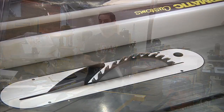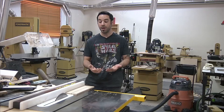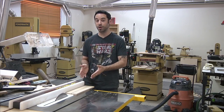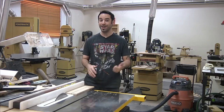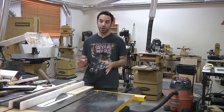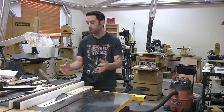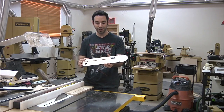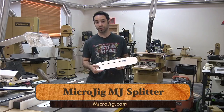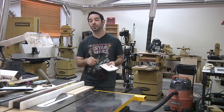Hopefully your saw came with a good quality splitter or riving knife. But if it didn't, you're going to need to think about some sort of aftermarket solution. A lot of us buy our saws used and sometimes those guards get thrown to the side and never seen again. So it's important to have some sort of aftermarket splitter in place to prevent kickbacks. One of the best ones on the market — because it's very easy to install, very inexpensive, and instead of attaching to the metal of the saw it actually attaches to your zero clearance insert — is the Microjig MJ Splitter System. It's been around for a while and I think it's worth checking out.